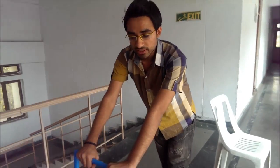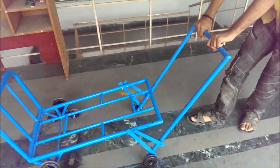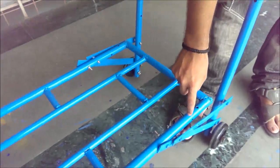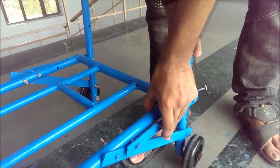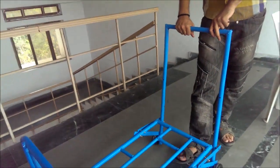So we decided to incorporate the concept of the folding bed. The third difficulty we faced was: as you can see, I can easily push this trolley, but when I try to pull it, the handle starts folding. To tackle this problem, we decided to drill a hole through this horizontal sheet metal and this horizontal rod and to drive a screw through these holes. Now the pulling of the trolley is also allowed.